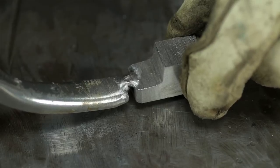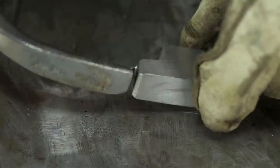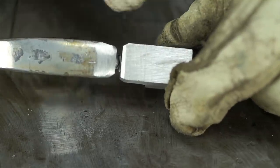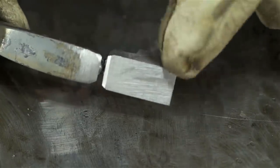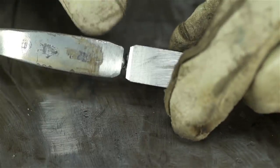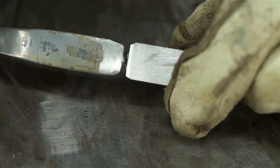I fouled the electrode trying to get that tack in there around the clamps that were holding the parts in place, but I managed to get it. What I was trying to do is bridge that large gap, so now I have something I can weld down into. This weld and the extension will be ground to get to the shape I want. The welds really have to be 100% — anything superficial will end up just being ground off and the thing will fall apart again.